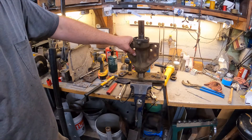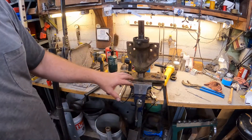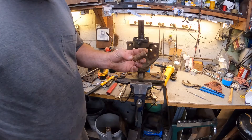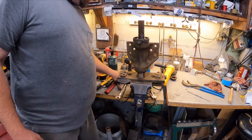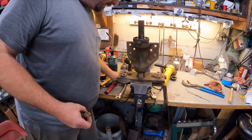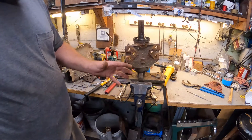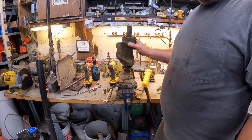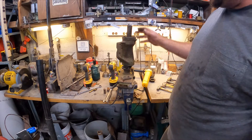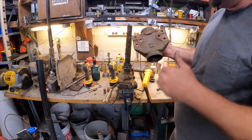Alright, we got those blades out pretty quick. I'm not having good luck with diagrams so I'm not sure if these pins come out, but it looks like you just turn them aside then pop the pin out - and these pins look like they're tapered. They're actually worn pretty good so I'm debating whether I should just replace them. I actually didn't need to press for this - I used a brass mallet and smacked it a few times while holding it and it popped, so it all came apart.